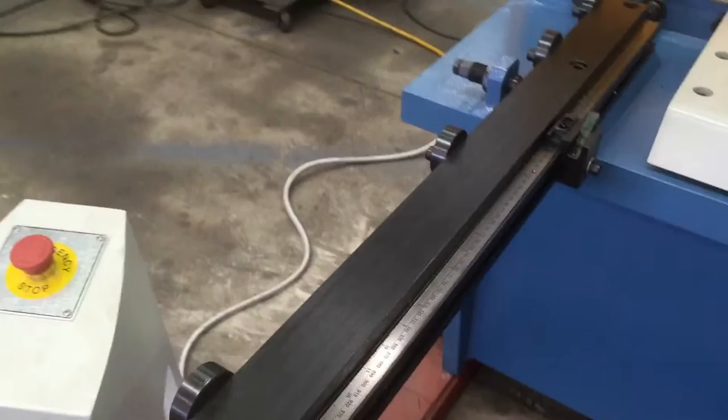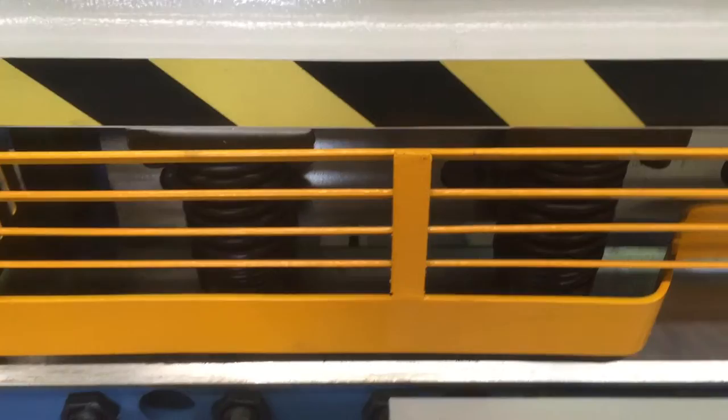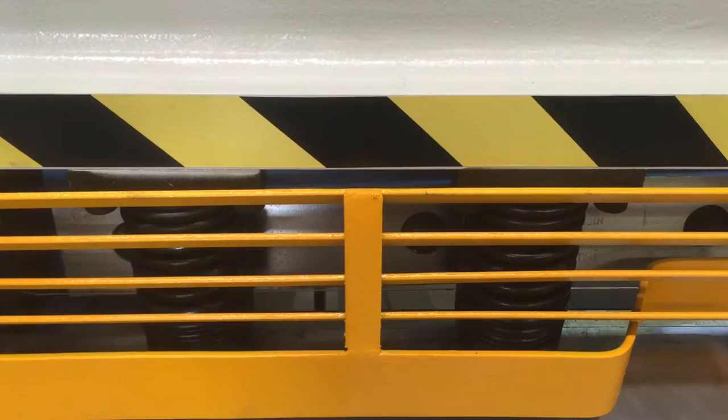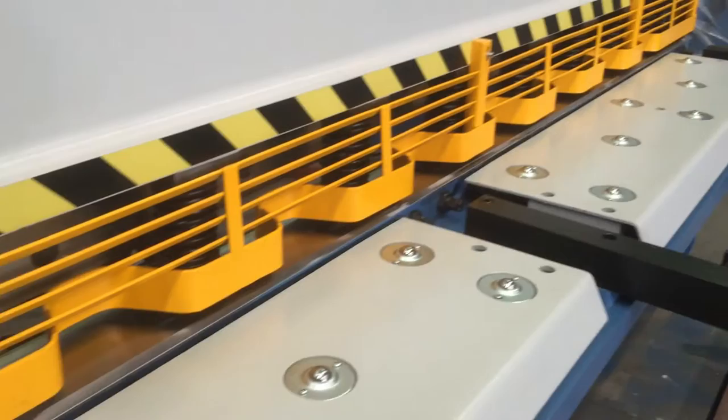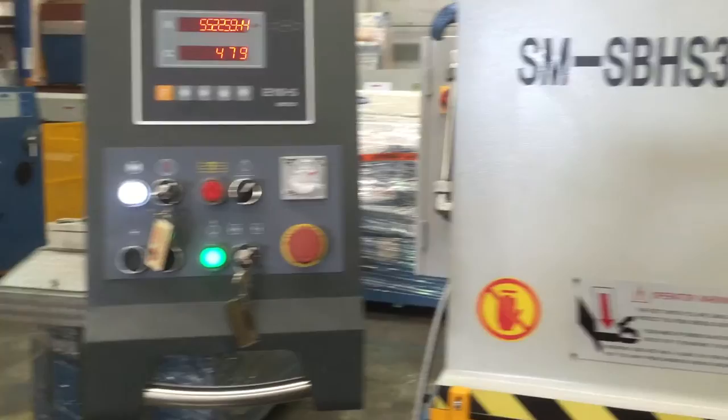One of the features that operators like is the lucite front guards — it gives a nice visual straight down to your cutting area. A string line of lighting of course shows a nice crisp line over your cutting area, and individual clamping jacks as you can see all the way along the front. Roller ball transfers on it, and we've got E-stops on that end, over here, one over there, and one down there. Safety is also the main feature on these units.